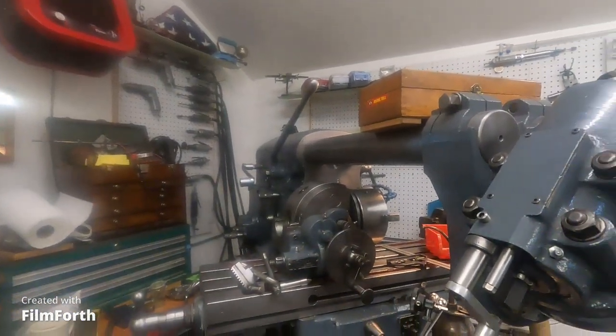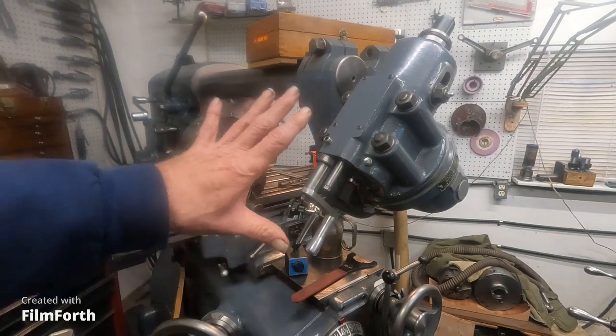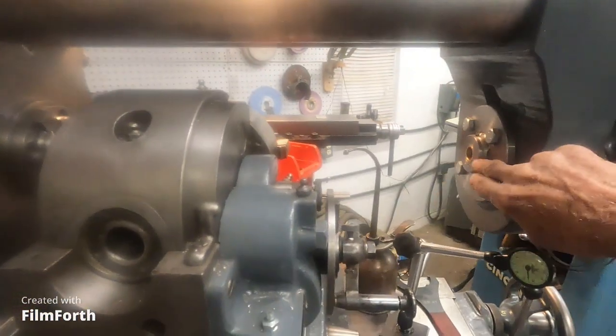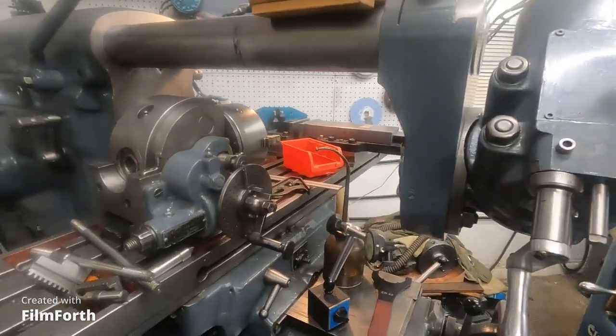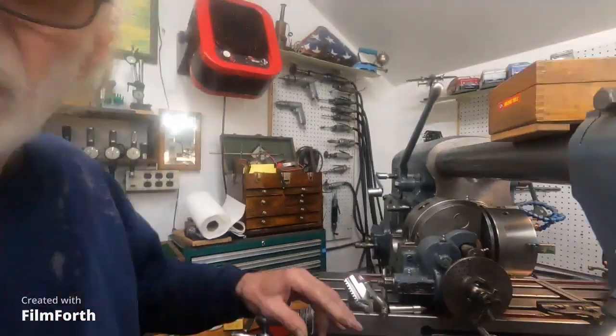Here I've got a really cool reproduction of a 1950s tool room — milling-type machines with this really cool Brown & Sharp mill with the sliding vertical head. It's driven by a spline. You can put an adapter in there and also run horizontal arbors and leave this attached. It's a very unique machine that was made for a very short time during the war, then replaced with the sliding head mill Model 20 Rangemaster, which is an extremely hard to find machine and really pretty cool.